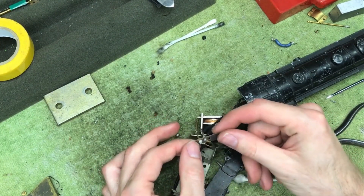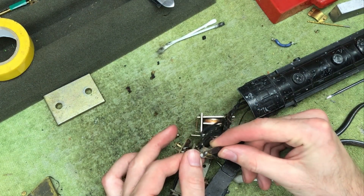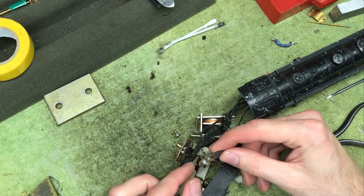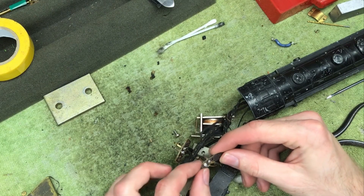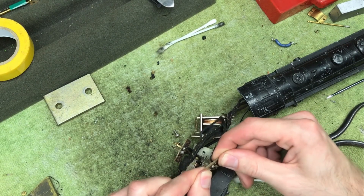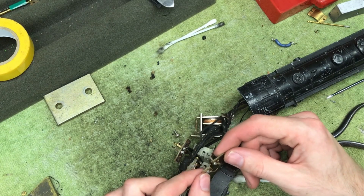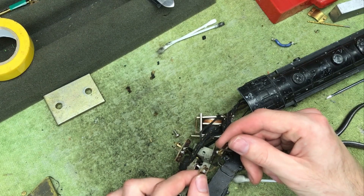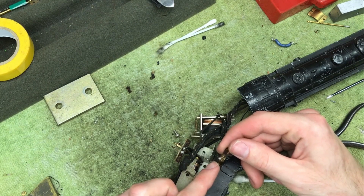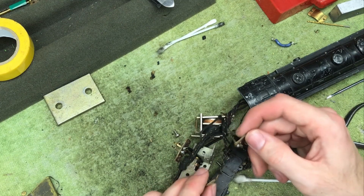This is why you want to be very careful with this phenolic plastic material, because when I was removing this side, the corner caught underneath the solenoid and the entire board split in half. Fortunately, I think I will be able to salvage it by just gluing it back together. You can see this was possibly built as a kit — there's a poor solder job on this finger, just balled up, so I will reflow the solder on there to make it a little bit better.